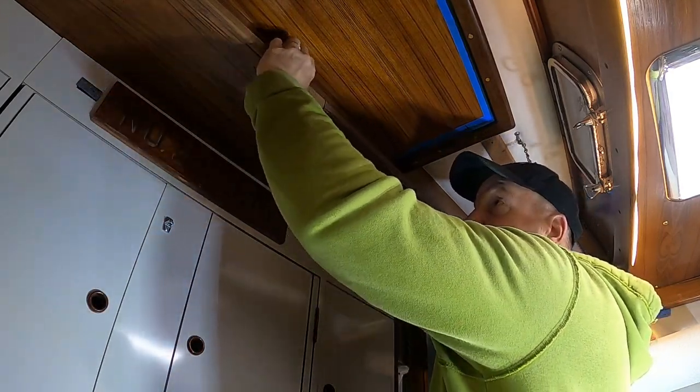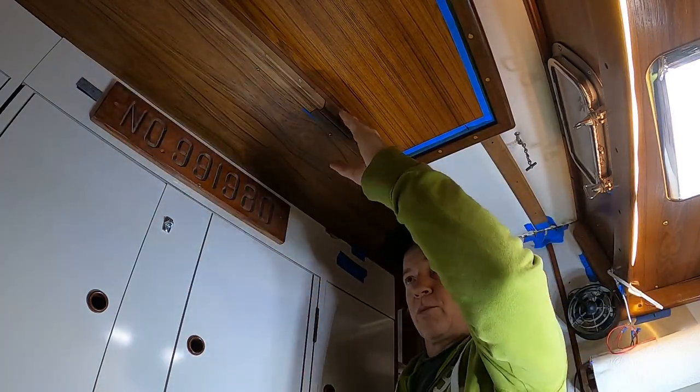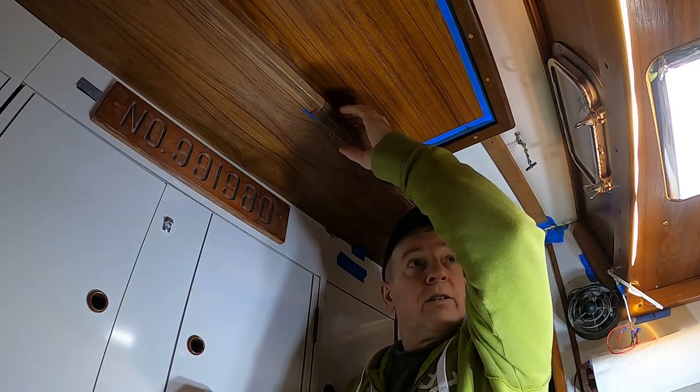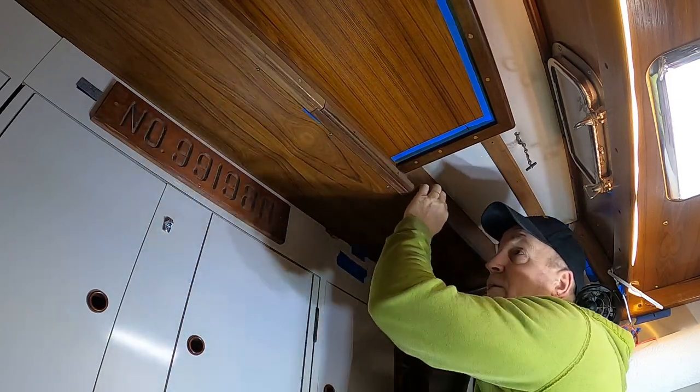And that's just a continuation of this trim right here. So it's not made to be structural. All it is really just to make sure that we get the right spacing. I want about a 1/2 inch shelf up here, just like what we have on the other side over here. So anyways, we have that now.